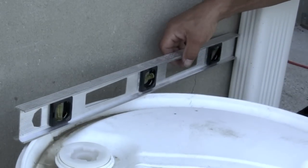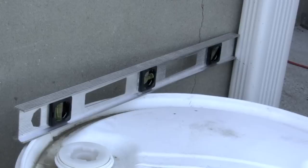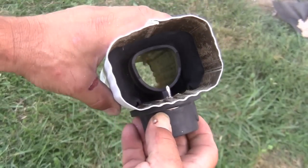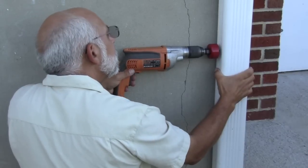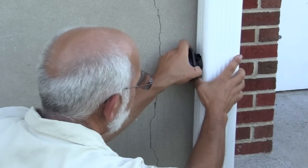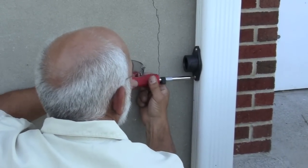With your barrel in place, set a level on top, move it over to reach the downspout, check the bubble, and make a mark on the downspout level with the top of the barrel. Make another line in the middle of the downspout. The FlexiFit diverter works with two sizes of downspouts — two by three inches and three by four inches — so be sure you mark and drill only on the three-inch side. Use the largest hole saw to cut into the downspout. Make sure the arrow points up as you squeeze the diverter sides and push it straight into the hole, then use two self-tapping screws to hold the diverter in place.